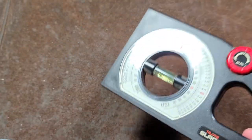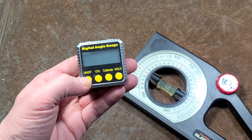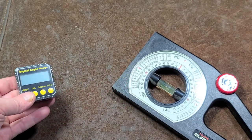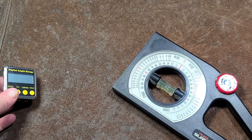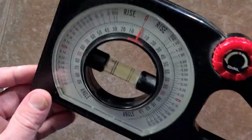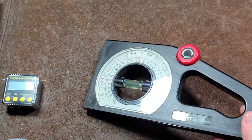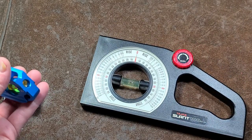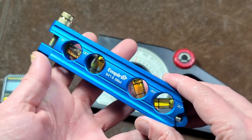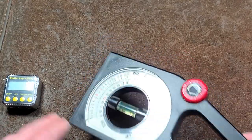It has a very large and precise scale based on a bubble. I've got Harbor Freight digital angle finders — they generally work okay, and many digital ones do work okay. The problem with the Harbor Freight is it just tears down batteries whether or not you're using it. I really hate that. The other thing is sometimes these electronic ones for one reason or another seem to end up acting a little funny. If you're a carpenter, you'll just be using a speed square; an electrician might use a bubble level with the four common angles — zero, 90, 45, and 30.